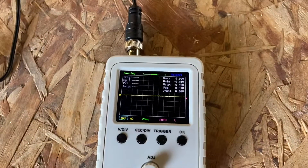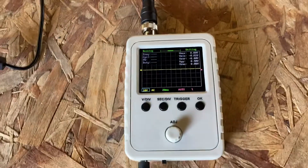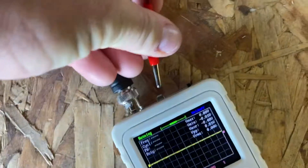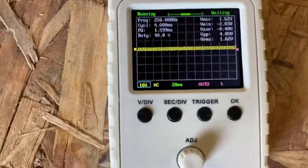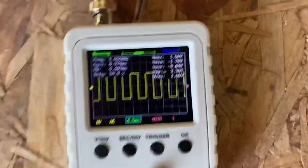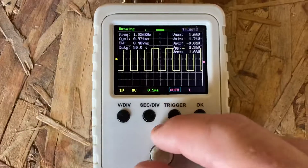This oscilloscope is about $30 from AliExpress. Took me about a month and a half to get it, but it's kind of cool for what it is. What's cool about this is there's actually a test function. If I take the terminals and there's a tab on top, it actually has a test function. I've got that set to one volt. You can see its test output — it does create a nice little square wave, just to kind of test that it's actually working. You can change the trigger.